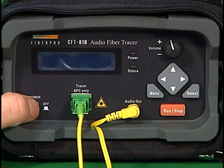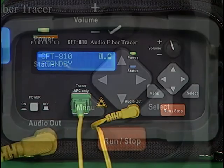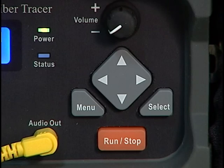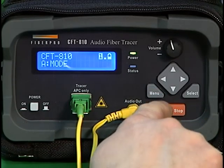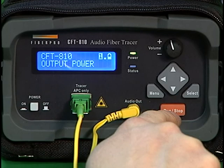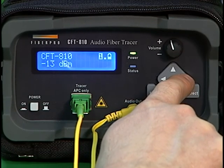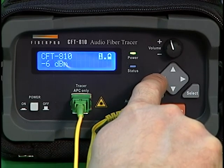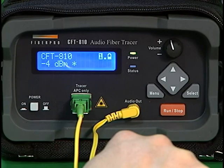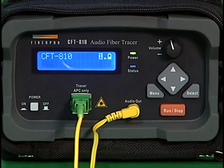Press the power button to switch the instrument on. The illuminated LCD display will indicate that the instrument is initializing and will then enter standby mode. All functions of the instrument can be accessed using the menu, select, and the up and down arrow keys. Before using the instrument for the first time, set the laser power output and operating wavelength. Press menu and use the right arrow key until Setup is displayed, then press Select. The display will now show Output Power — press Select again. Use the right and left arrow keys to cycle through the available power levels. The current power level will be highlighted by an asterisk. In most cases, you'll want to use the highest output power. When you see the desired power level, press Select, and the instrument will set your desired power level and return to standby mode.